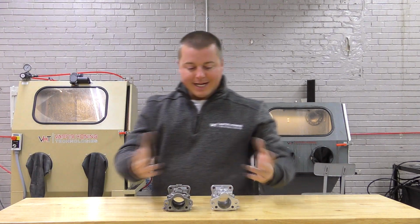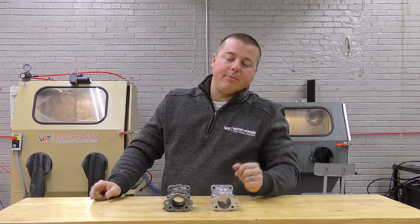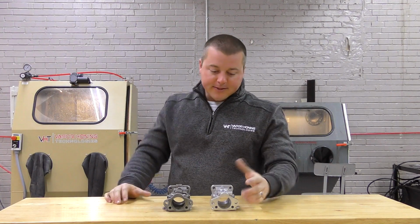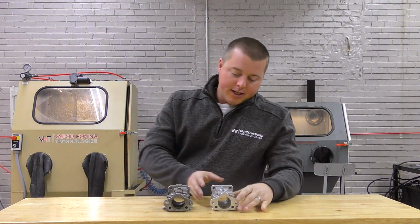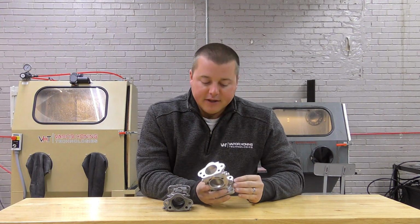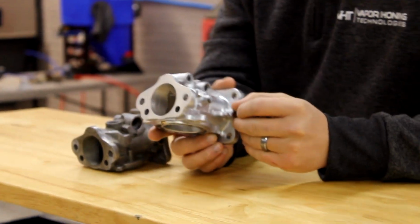If you were to glass media dry blast this item, you're going to smudge the surface. You're actually going to cover up this crack potentially because you are moving the material many different ways, and many times masking that crack, which may need attention before you rebuild. Because this is where a butterfly valve goes. So obviously that's a very important item on this carburetor, so you don't want this part completely breaking. Could cause some catastrophic failure on the valve.